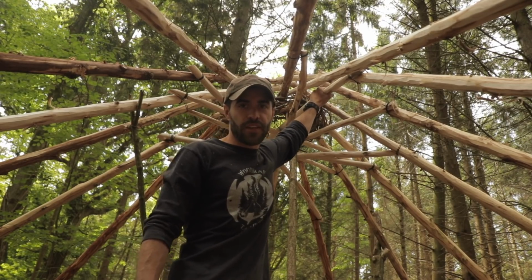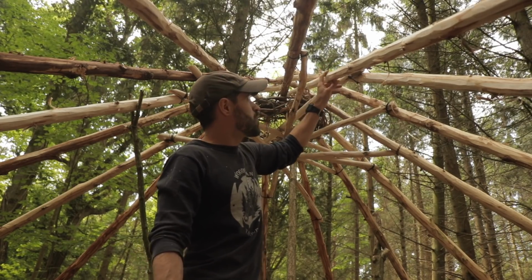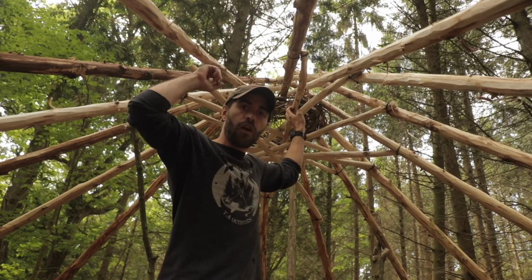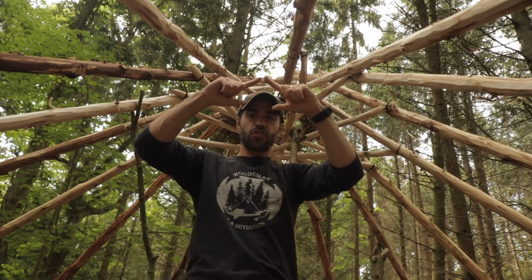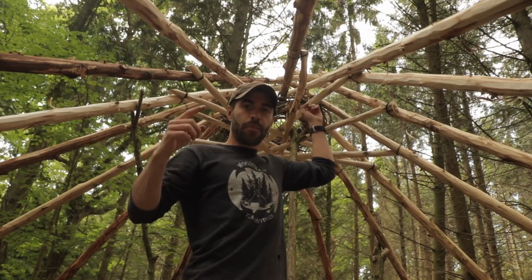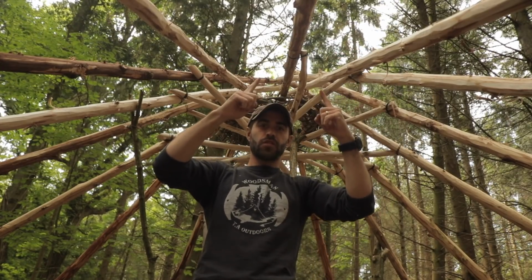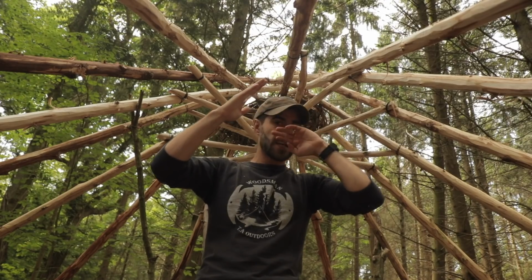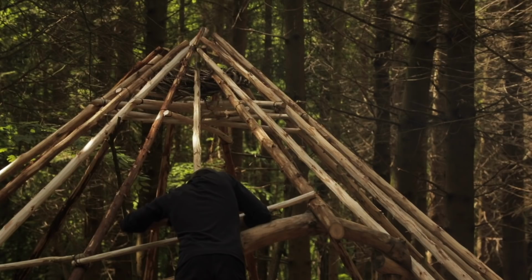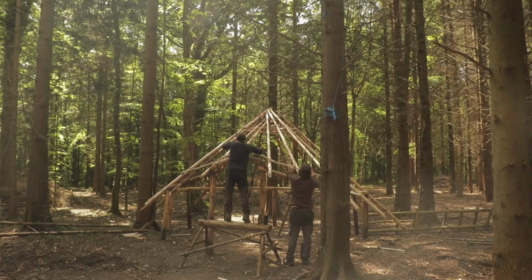They don't look pretty, I know, it's a bit like a spider's web, but each rafter, except this one, has a cross support locked in to a rafter that's opposite it. This makes a triangle shape, and we all know triangles are the strongest shape. So by putting these in up here, imagine all that thatch and that weight on top of here. All these rafters are going to lean into each other. So essentially we're using the laws of physics so that each rafter, when there's weight on it, will just lean into each other, and that's where that cross support comes in.